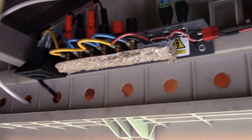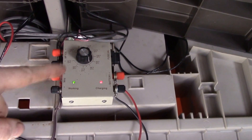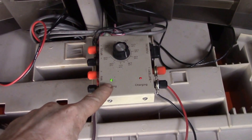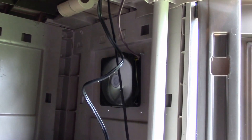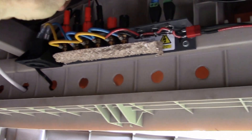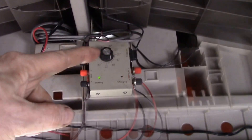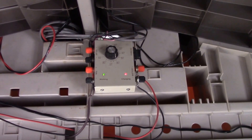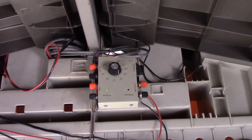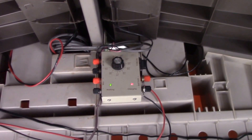This is my jump start battery right here, which isn't plugged in right now. I'm going to unplug the backpack sprayer so I've got no batteries in the system — and see, the charge controller just starts flashing because it doesn't see any battery voltage. But the fan is still running! Even with no batteries in the system this fan will still work. Then if I plug in a battery, now I've got a battery and it's just in float charge. It's a very clever little controller — it's the only solar charge controller I know that'll run without a battery.